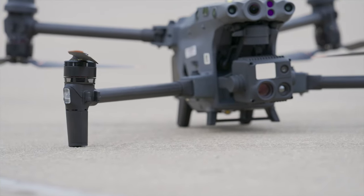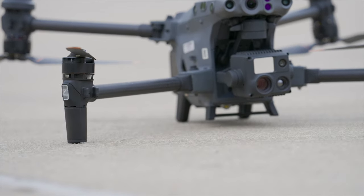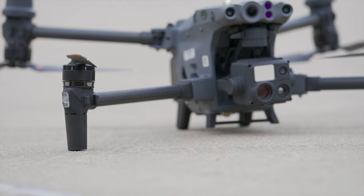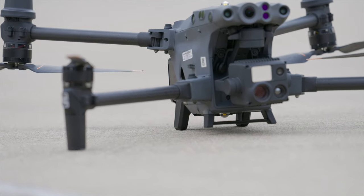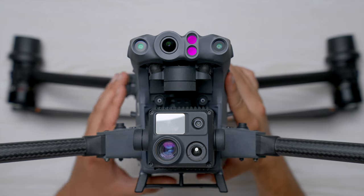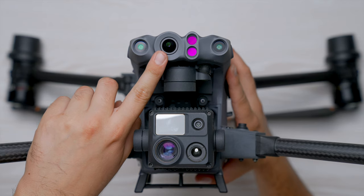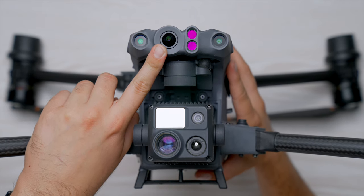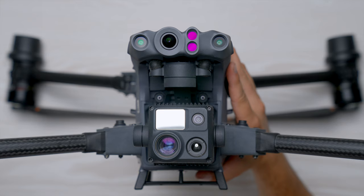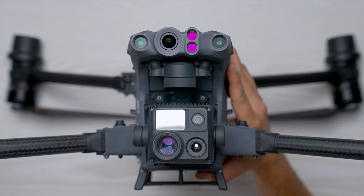The landing points are worth pointing out since this drone ditches the big external landing gear of the M300. On the ground the drone primarily sits on the two front legs on each arm — which double as antennas — and rests on two support areas underneath, all with a rubber finish to prevent slipping during takeoff or landing. The front side has the same four obstacle avoidance sensors as all other sides, plus an FPV camera for wide navigation — useful whether flying solo or in dual-pilot operation where the second pilot controls the gimbal.